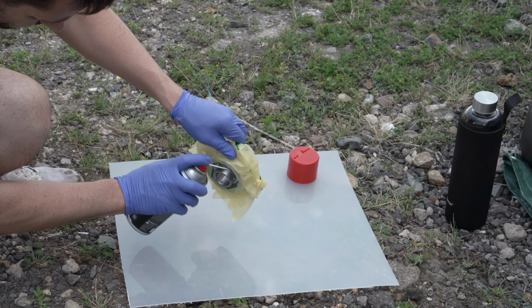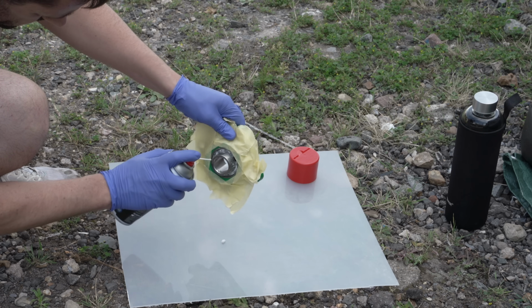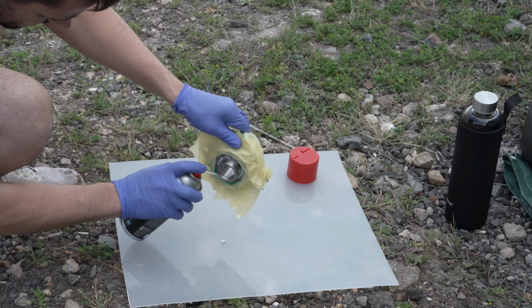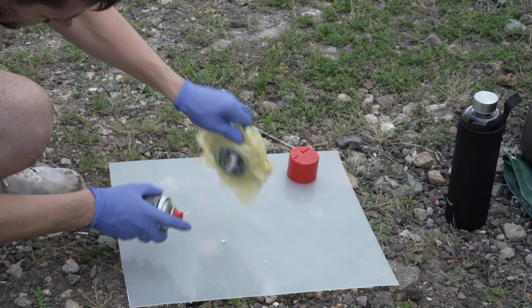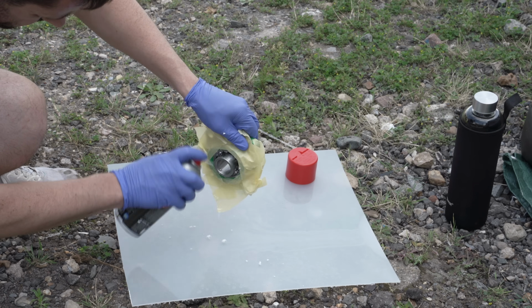You'll notice I only took one side off the bearing to keep the other seal and shield unprised, so the cleaner does need to be nitrile rubber compatible. Most of it comes out easily, with concerted squirts to use the best of the compressed can's oomph, and some shakes to encourage the globs to fall out.